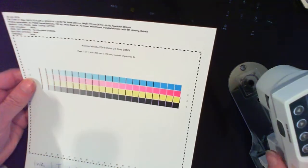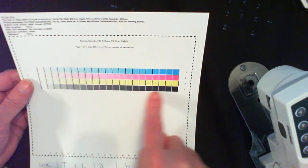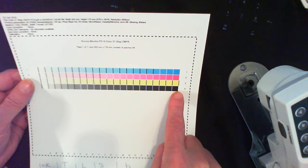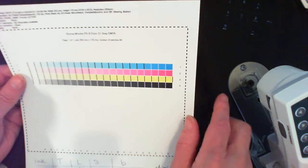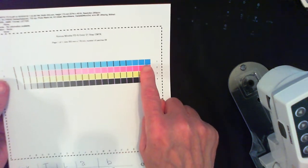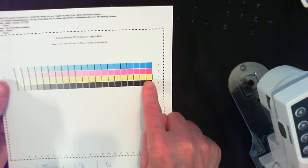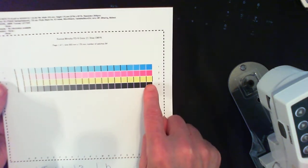All right, now on to this sheet of paper. This sheet of paper is Canon photo mat. This is the first step of the calibration process, or linearization process, in a RIP made by a company called Oris. Now I'm interested in the measurements of these colors because these determine the extent of the gamut for this printer.